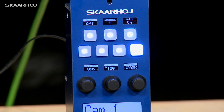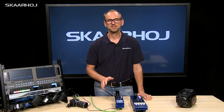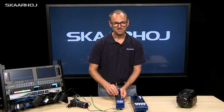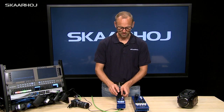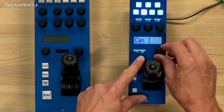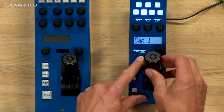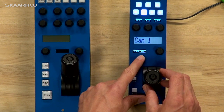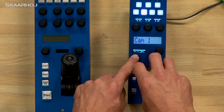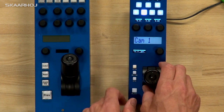And then finally, we have a reset all feature. The lower section of the RCP Mini is more or less designed like on the bigger brother. We have the classic iris joystick, and you have the display reflecting what the values are. We have a limiting function here, so you can set a top limit for the iris — now we couldn't go any higher than 82%. We also have the master black wheel on the joystick, which is called Lift Y on a Blackmagic camera, and that's reflected in the left side of the display.